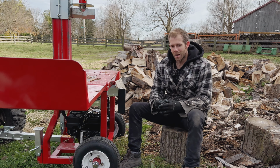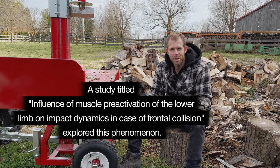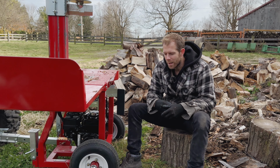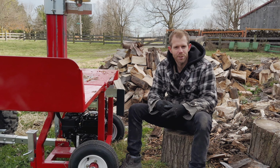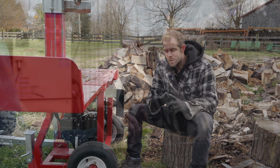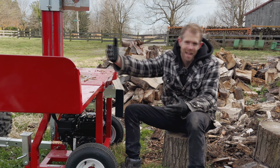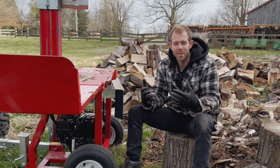Number one is that under a lot of conditions, humans have the tendency of stiffening up and freezing when they get into some sort of an accident, a mishap, something like that. At the shop, we see a ton of our machines, whether it's the robotics or the foot pedals for our press brakes, that kind of stuff. They've got three positions. When you're not touching it, it's e-stopping. If you're holding it lightly, it's operating. And when you're pressing it way too hard, AKA the robot is coming towards you and you're squeezing it, you're tensing up, it also runs an e-stop alert on the machine.